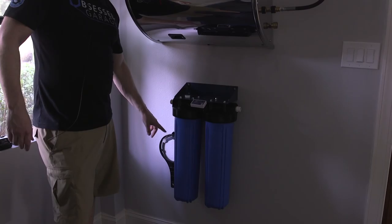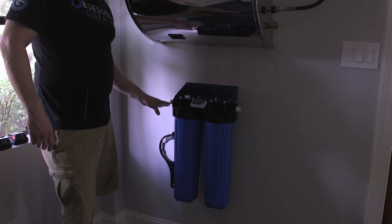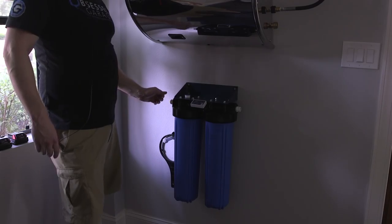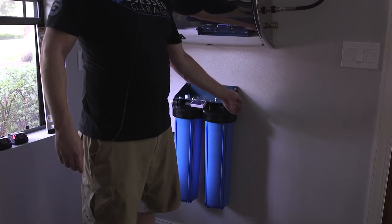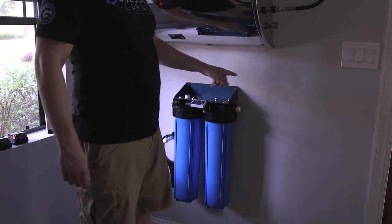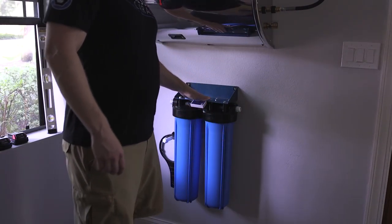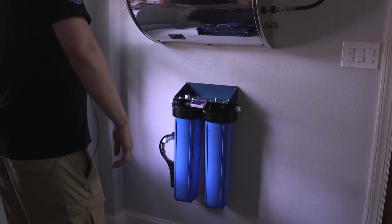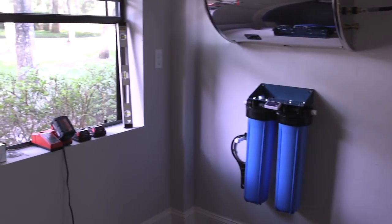So here's my bib. So I got a threaded outlet. So you need to come out, whatever that is, 3 inches up. I need to fit a valve in here somewhere. So to turn it off, I need a bypass, which will come down to here, another valve here. So valve, and then over into the pressure washer. But what I'm going to do for now, I'm going to just stick the hose in from the side here and take the screen out and just run it into the side of the pressure washer, right through the window here on the side.